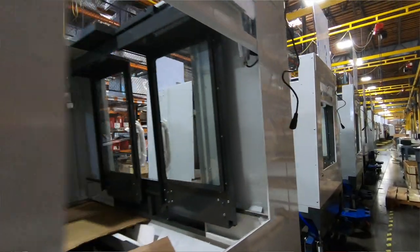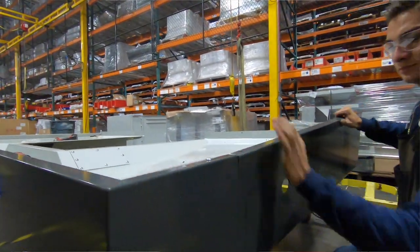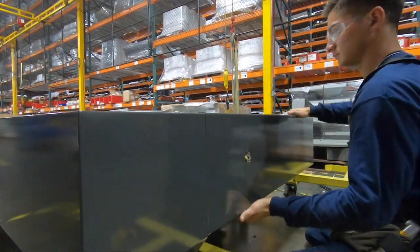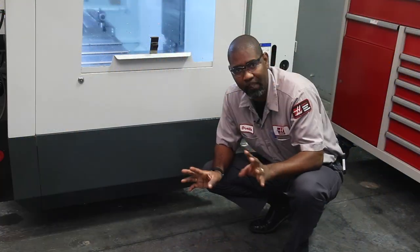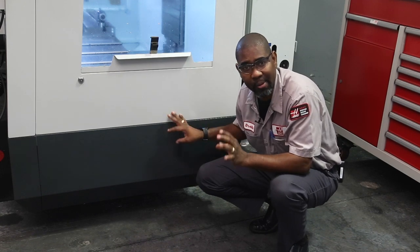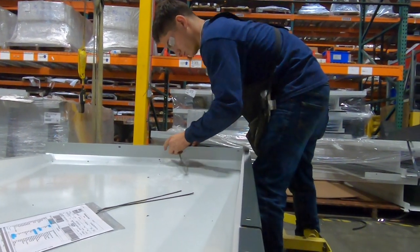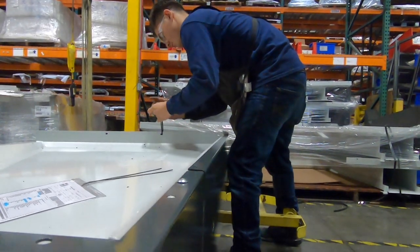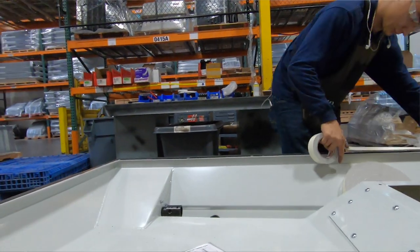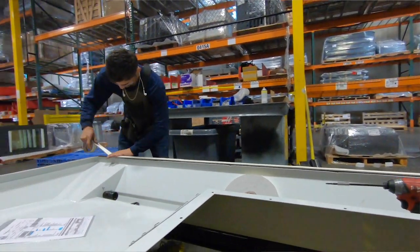These enclosures are built on a dedicated assembly line and are assembled by people who do this job every day. They have all the tools they need and an optimum working environment. If you are replacing an entire panel in the field, no matter how much time you take or how much care you use, you will never get that enclosure back together quite as well as the assemblers did in the factory. You are working with joints that have been bonded together for some length of time, and you're probably putting panels together in a different order than they were designed for, and you certainly haven't had as much practice as the original assemblers.